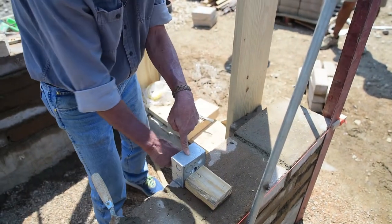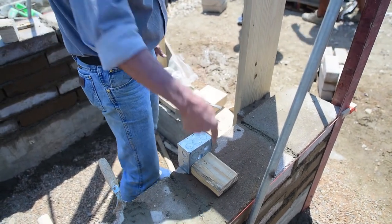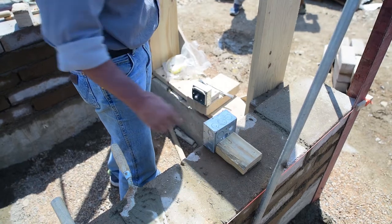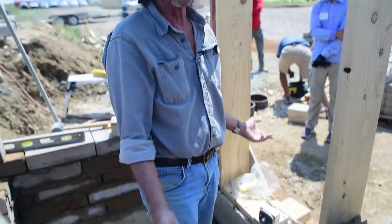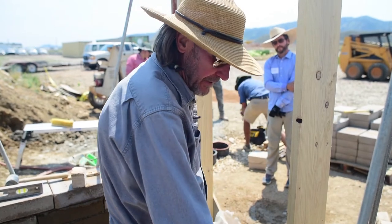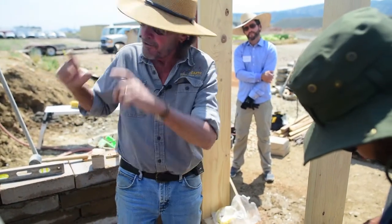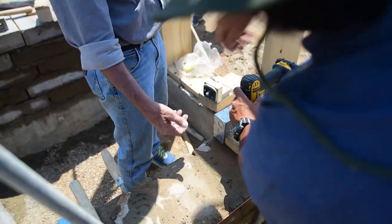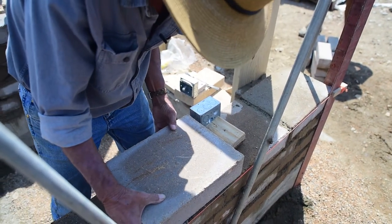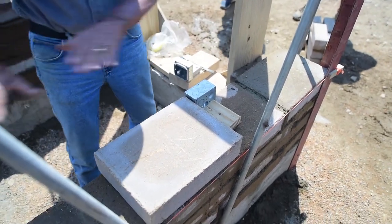We screw through the box into the two-by-four. We're not wiring this building — this is only for your benefit, demonstration. So then we screw this down. The other big advantage I mentioned is that it's a four-by-four metal box, meaning it's four inches high. So when the next course comes in and has mortar underneath it, it will match the top of this box perfectly, so that you can just go right over it with the next course.